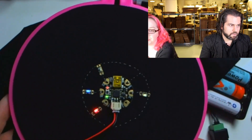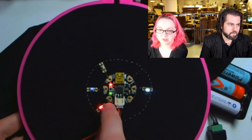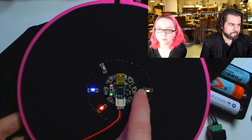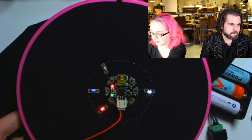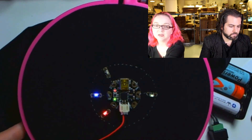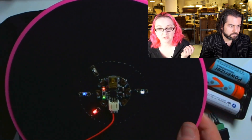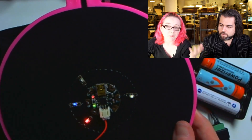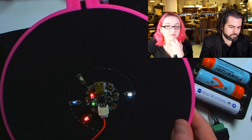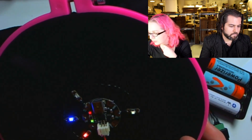Here is an example of them sewn on. Here's a Gemma — I have this red one on all the time. The blue, green, and white ones pulse on and off. You can see the green one blinking and the blue one. It's very easy to control with a digital pin. Unlike NeoPixels, they only do one color each, but they're a lot less expensive and a lot smaller. If you just want a couple of white LEDs to flicker or blink, you can use PWM outputs. The Gemma has two or three PWM outputs.